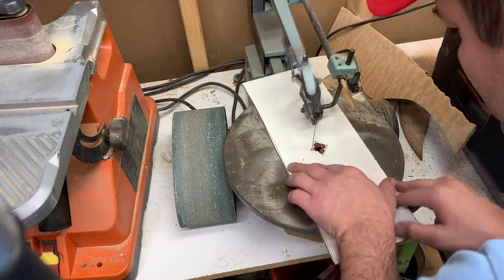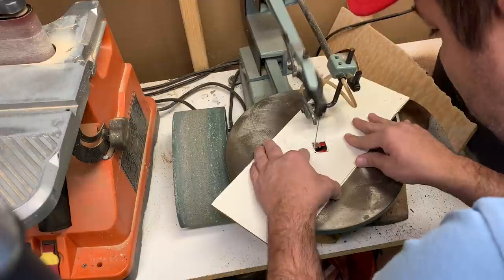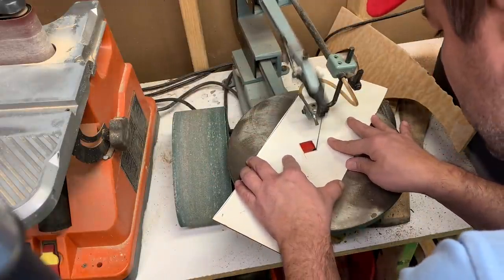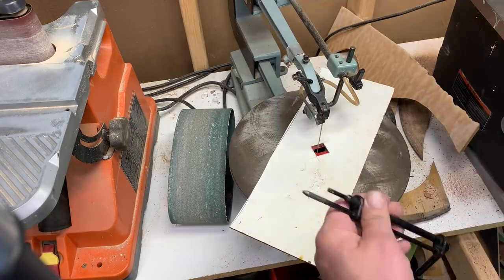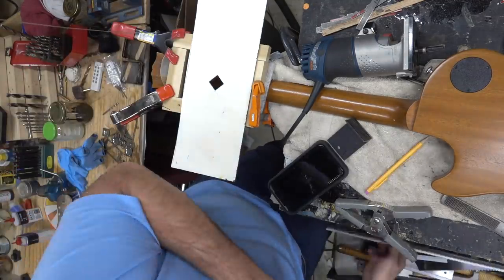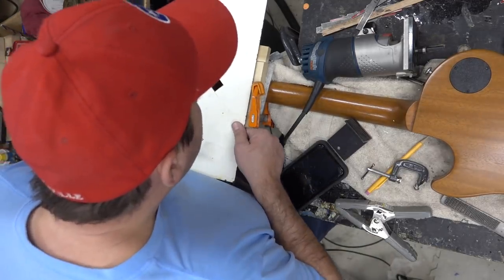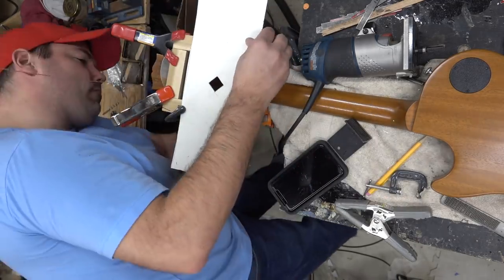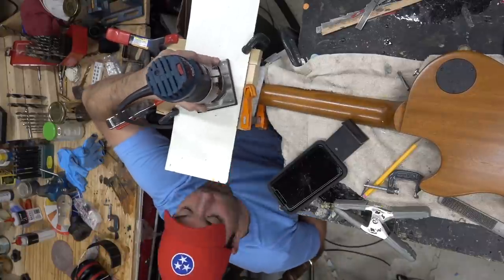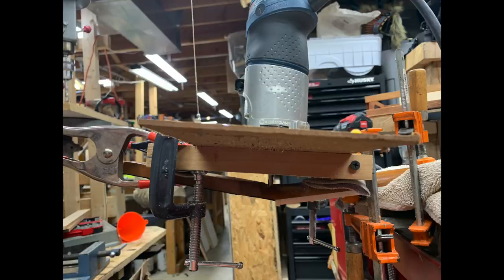This is my oldest tool in the shop — my grandfather's jigsaw, who kind of got me into all of this. We're gonna cut that square out as close as we can to those lines, then use a file to make sure it's all cleaned up to the approximate size I want. I'm going to clamp this down — this box I made clamps to the headstock, and I clamp the board template to that box, which has a single screw in the middle on each side, so you can see just how it looks underneath and we'll take out the perfect amount.